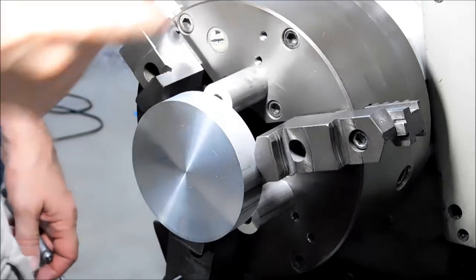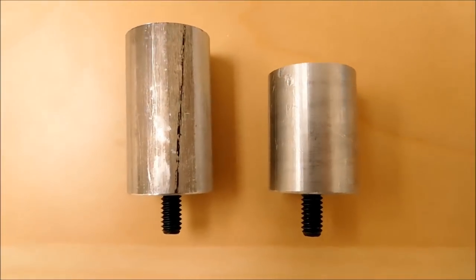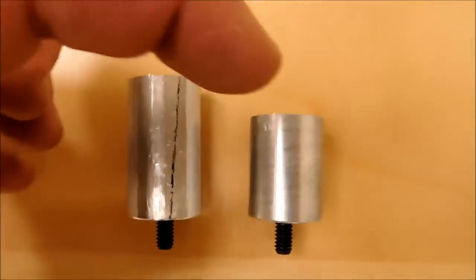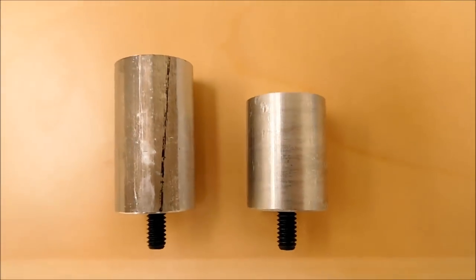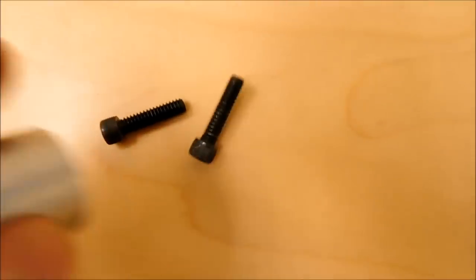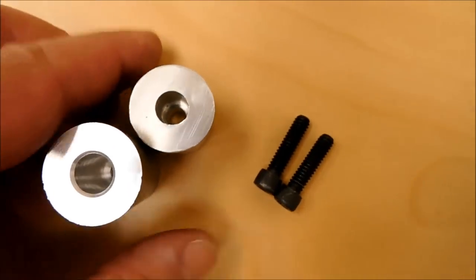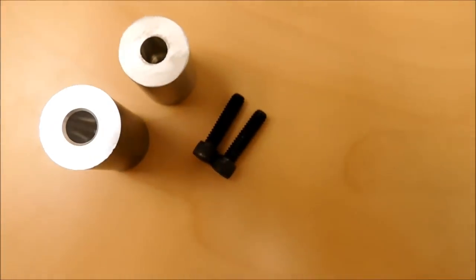If I were you, drill the face of your chuck, make a couple of these standoffs. For sake of convenience, if you end up with a lot of standoffs, make sure it's not the depth of the counterbore for the head that is common across all sizes, but how much material you leave behind. You can see these standoffs are different sizes, but the projection of the thread is exactly the same and the screws are the same. So you don't have to search all over your shop for different types of screws depending on how tall your standoffs are. Just make the counterbore thickness of the bottom common across all your sizes — it'll save you a lot of headaches and you'll only need three screws.